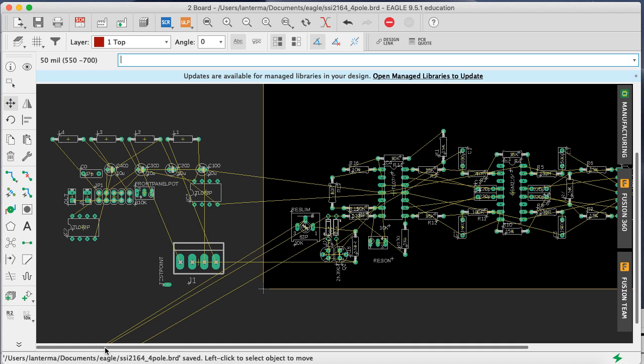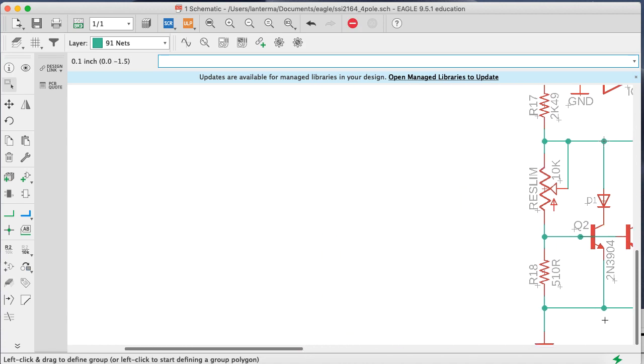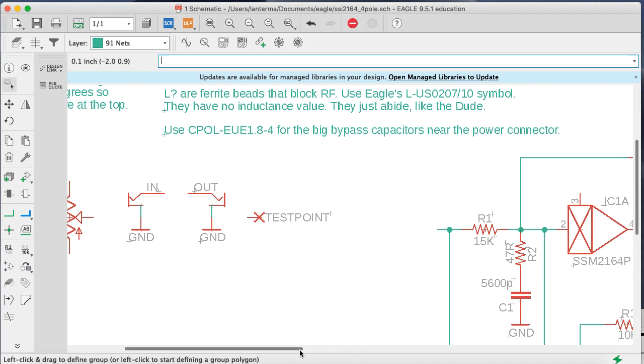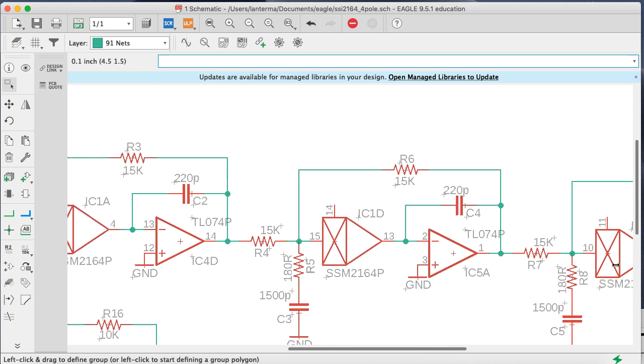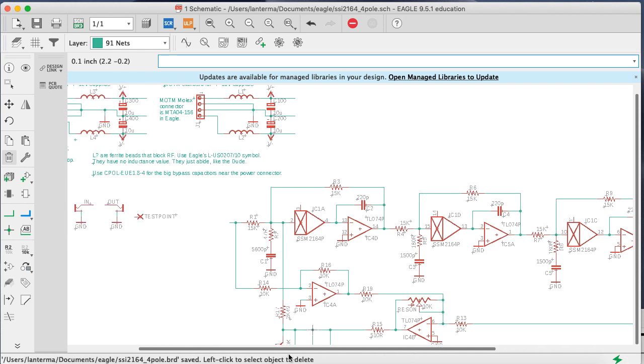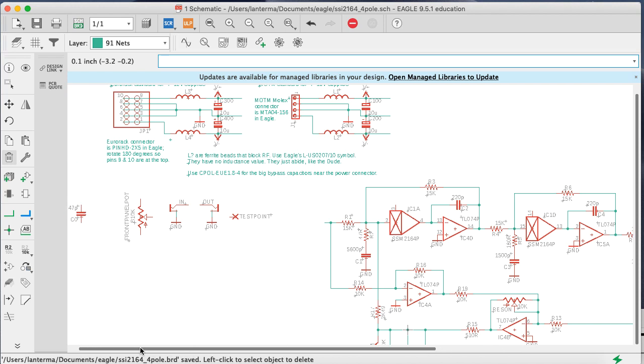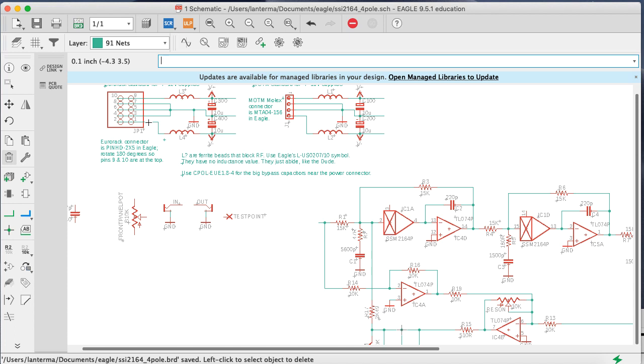All right. Now I had some dual op amps in the original design. Let me just go in and get rid of those to avoid cluttering up my brain here. Where did you go? Here's TL072 things. Let's get rid of those. And, oh, you know what? I should hook up power. So eventually I'll set this up. This is part of my template to take either Euro or MOTM style connection. So we'll set this up to use either ±15 or ±12.